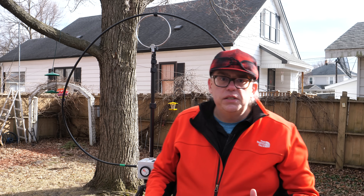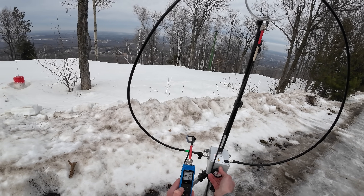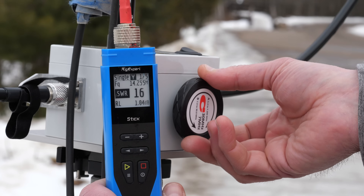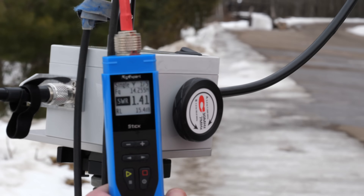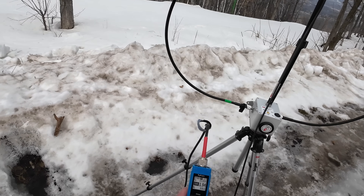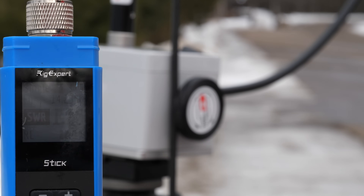Basically, if you want to change frequencies, you're going to have to readjust the antenna. There are two methods of tuning. The first is to use an antenna analyzer — connect it and turn the tuning knob until you see a dip on the meter. As you are tuning, you will notice that touching the unit will slightly detune it, so you need to step away to get an accurate reading. The knob is very sensitive, and the 6-to-1 reduction drive lets you make very precise adjustments. When you get it into the ballpark, it will take very slight movements to hit that sweet spot.